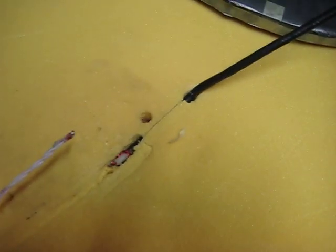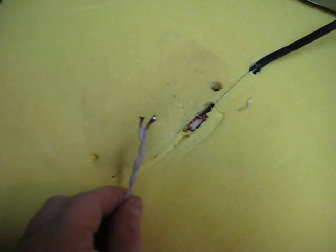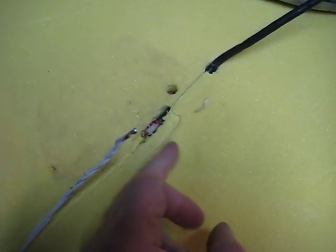This is a faulty coil. It was intermittent, and these are the wires here from the actual coil, and the one to the center just fell off as I touched it. It was just a dry joint just sitting there.